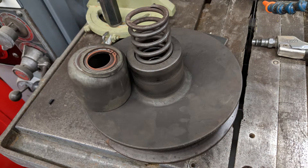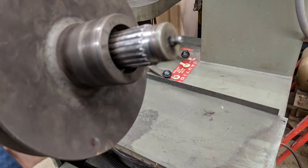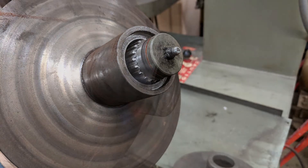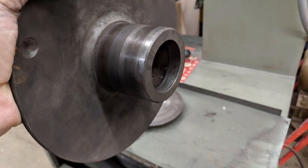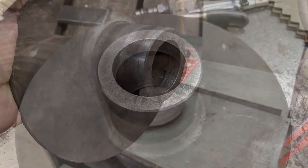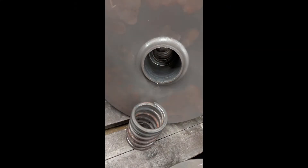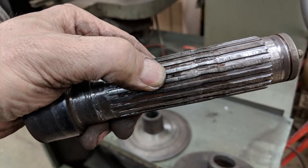I figured I could repair my unit with standard drive components, but after taking it apart I could see that even if I got a motor keyed shaft coupler, some spline shafting, and a spline coupler to braze into the rebored pulleys, there was not enough room to build a replacement for the $362 shaft from separate parts — it would all need to be machined from solid. So I figured I could put a fixed pulley on the motor to replace the bad VariDrive and add a variable frequency AC drive to retain the variable speed capability.